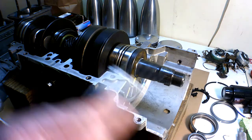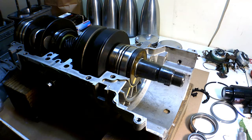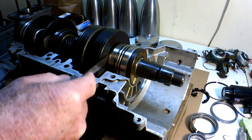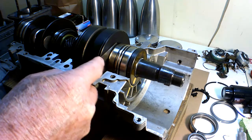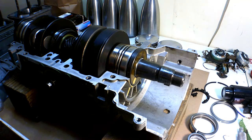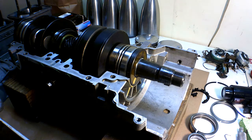I can't tell you how this modification here where I cut that spacer down could do any harm — that's the main thing. I'm going to modify it and I can't see how it'll do any harm. The spacer that goes back here you have to be real careful on because it's supposed to clear a radius — when they grind these crankshafts they can't make a sharp corner. There's always going to be a radius in the corner, and that spacer on one side has a radius to take care of that. You want to pay attention to that when you put it back together. You've just got to be real careful and keep everything real clean. I don't think I hurt anything and I think it's going to run at least another 20 years — that's what I wanted.